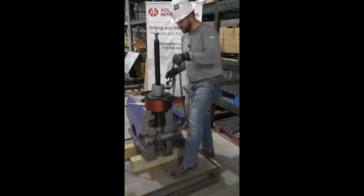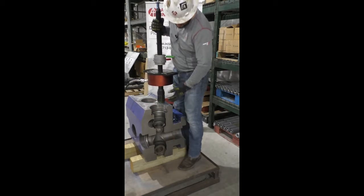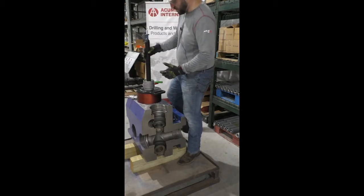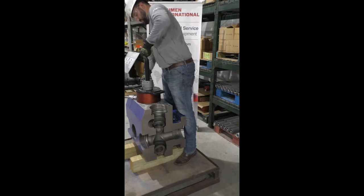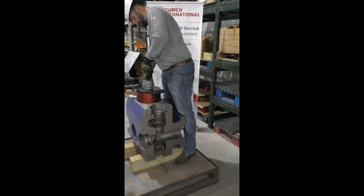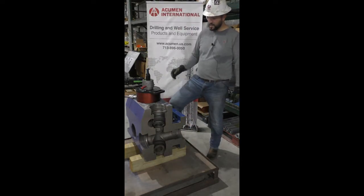Then move to pull this seat — make sure the seat is loose, it is. Take the tie-down off. I personally like to keep it all assembled, but you can take it apart. Release the seat in the fluid end, take the whole thing out, make sure your seat's not on it, and go directly to the next hole. Make sure you engage that seat — just like that.